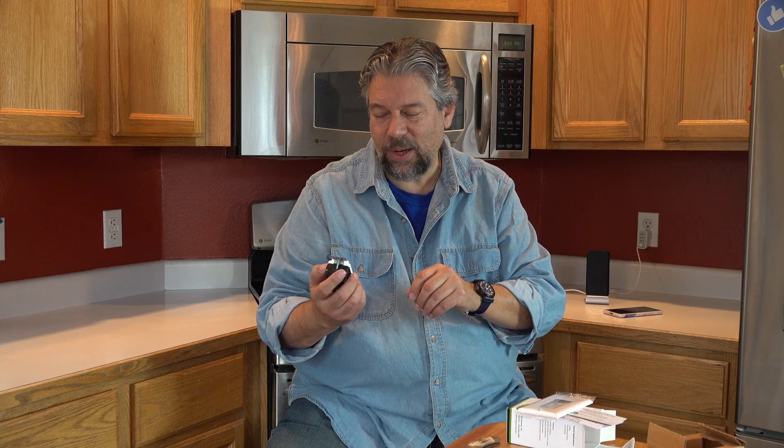What I'm going to do is switch over and give you a narrated photo tour, because you don't want to watch me do this live — it could be painful. Basically it's going to be pretty easy. I'm going to drop the power on that circuit — you always want to do that. Interestingly, that outlet is not on my GFCI, so I'll have to go out to my main breaker board to make sure that outlet is dead, and then I can switch it for this.